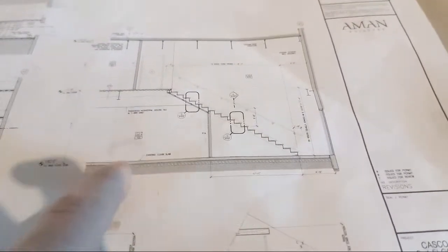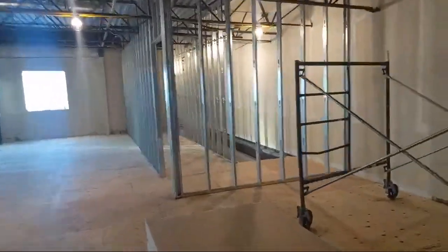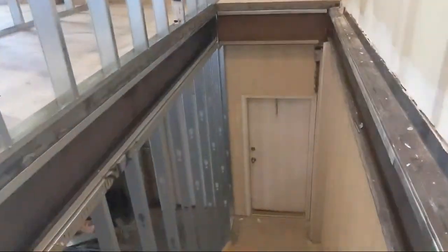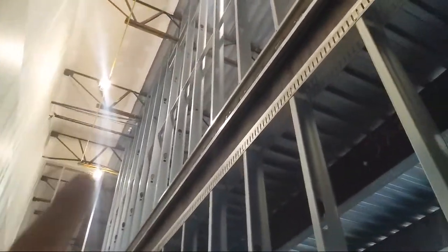And yeah, so then this is the downstairs one here. We built that little wall and a soffit right there. I can give you guys some more detail on that, actually. The idea is to always make sure the drywall has backing, okay? You have to, as a framer, envision the drywall going on and envision the finish, you know? Yeah, see, we still got to build a bulkhead around that beam too, okay? But I'm going to get more bakers set up in here. Baker scaffolding. I'm going to get like four bakers. And I'm going to show you how to set up the bakers for the stairwells properly, okay? So we'll show you how to set up the scaffolding, the bakers.